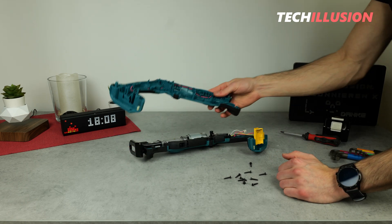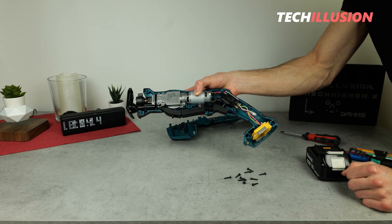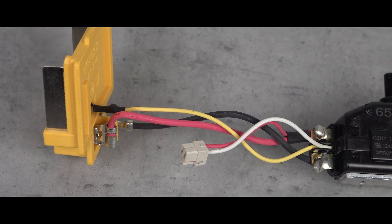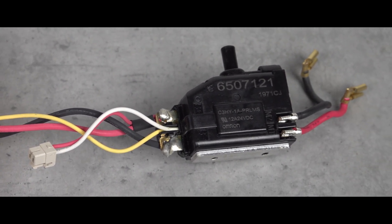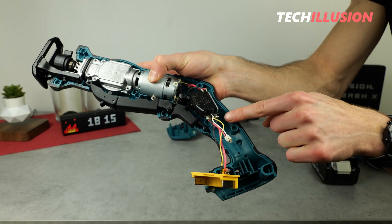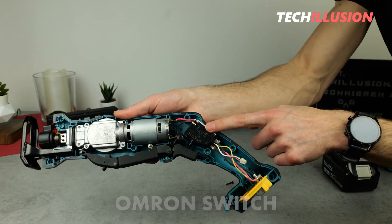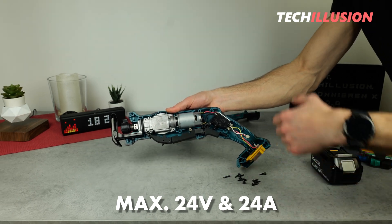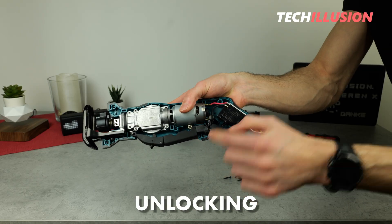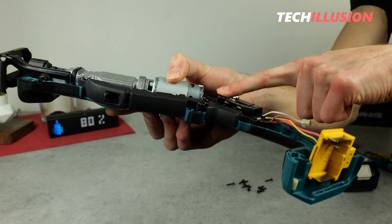There's nothing more to see on this part, so let's focus on the built-in technology now. Starting at the bottom of the machine with the battery: here in yellow you can see the base plate — the battery compartment where the battery is inserted into the machine. On the underside there are three pins, and on the top there are three corresponding wires: black and red for plus and minus, and yellow, presumably for additional control power. Everything flows directly into the built-in switch. The switch itself is a model from the brand Omron, designed for a maximum of 24 volts and 24 amperes — meaning slightly over 500 watts — which is entirely sufficient for this small reciprocating saw. To operate the switch, we need to unlock it first. The small reciprocating saw has a small release bolt positioned in the center, which is spring-loaded and, when pressed, clears the way for the actual switch.